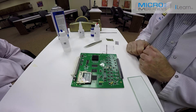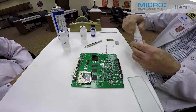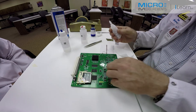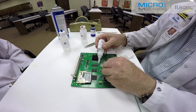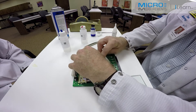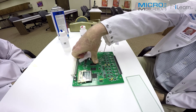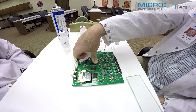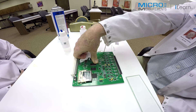I now have my 60 seconds of air dry time. I'm going to take the M-Bond 200, remove the cap, have a gauze sponge at the ready. Lift the gauge handling tape and put a single drop at the cusp of the gauge handling tape on the circuit board. Squeegee it over with the gauze sponge and then follow with my thumb. I'm going to press down firmly — approximately a third of a white thumbnail if you can see the thumbnail — and hold it for a full 60 second minute. Don't trust your brain, trust your watch. Your brain's in a hurry.